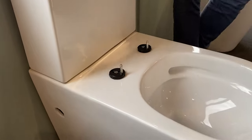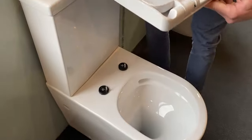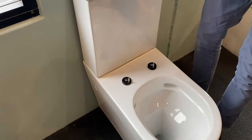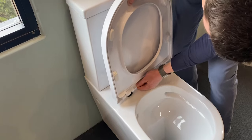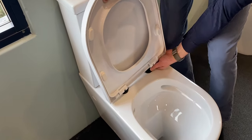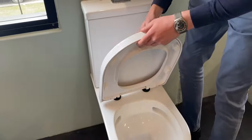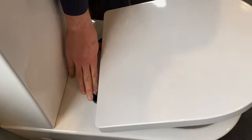Now to attach the toilet seat — I find the easiest way to line it up is when it's flat, not when it's upright. Normally the seat fixings come in the upright position. Put it on one side, push it across, push this one across so you can line them up and they clip on. Remember it's still loose at this stage and not aligned yet. Bring the seat down and hold these flat while the seat is soft closing.